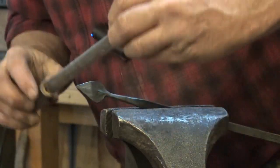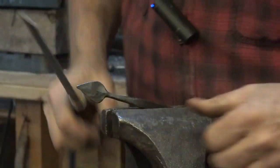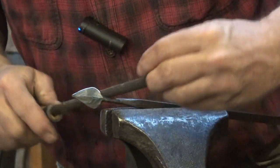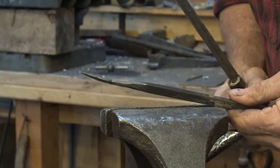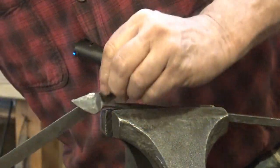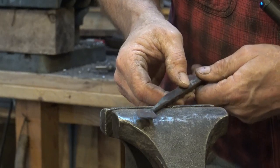Really this needs very little filing — there's just a few little odd divots in there. I'll also file a little bevel on the edge so it's a little crisper and better looking. The better job you do at the anvil, the less filing you're going to have to do. That's really all I'm going to do with that — I think that looks just a little bit cleaner. It's a very subtle difference; you may not be able to see it on the camera.